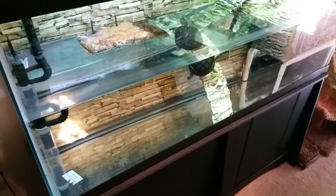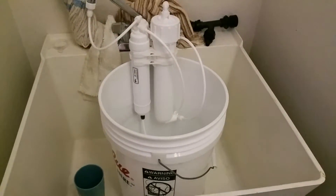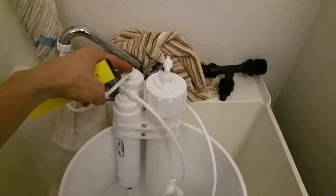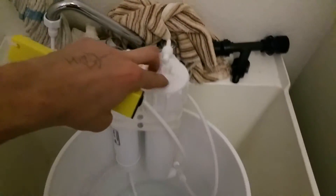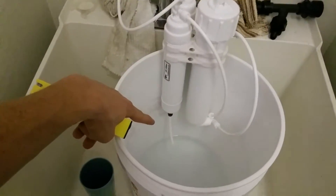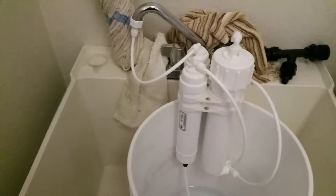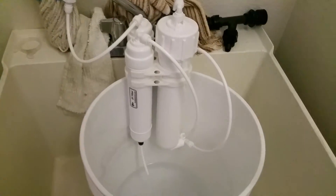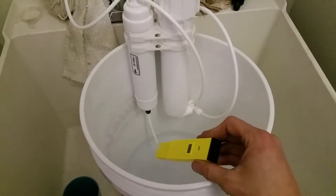Let me show you what I got to start getting this better. Here in my mud sink, this is a reverse osmosis system. I have tap water coming in, goes down to that one, up out of this one, through a semi-permeable membrane, back through a polishing, and then water out. It is still currently rinsing, but the theory is, and everything I was reading on these, says that the water out should be between a 5 and a 6 for pH.